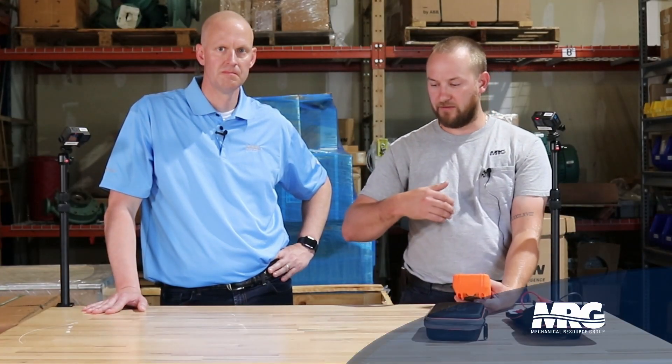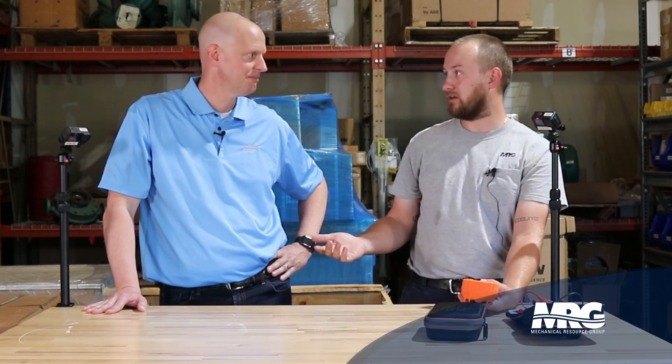Are you megging compressors? Absolutely. Something worth mentioning is a megohmmeter can be a diagnostic tool, but it's more so to be used as a trending tool. So if you're going out all the time on a PM contract and you're megging the motor, you're not supposed to just go out and condemn motors — that's not really its true purpose unless it's truly shorted to ground. This will help you find a short to ground. From a winding insulation testing standpoint, you should be conducting these tests regularly and monitoring them. That way, if the insulation is degrading, you can inform your customer — hey, the insulation has dropped 200 megohms, something's going on. There are other influences surrounding megohm testing — is the motor wet? Is the compressor full of liquid? A cooling tower motor is going to meg low because it's saturated, it's wet. A supply fan motor in a supply stream is going to meg low because the windings are wet.